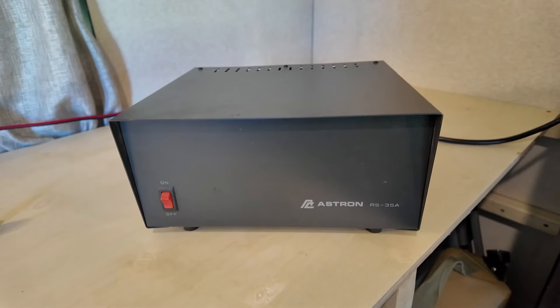One of the things I'm going to have to do right out of the gate is test out a new radio to make sure it's putting out the appropriate amount of power, and therefore I need power connections and meters and dummy loads. This right here is the Astron RS-35A. If you don't have a power supply, check with your local ham club first — there's probably about 30 or 40 of them floating around. I did a video linked up here for an easy entry-level switching power supply. This one's a linear power supply. Switching power supplies are much smaller and lightweight, but sometimes they make some noise, so make sure you get one that has circuitry to reduce the noise.